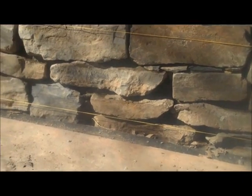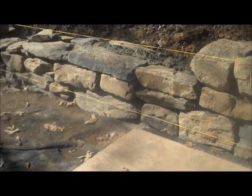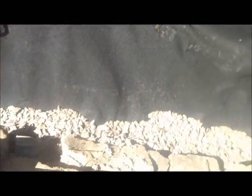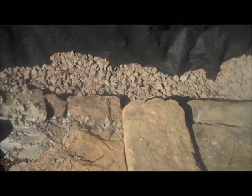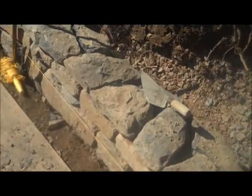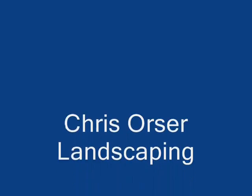It's just a really nice natural-looking wall, and with the techniques we put in behind the wall, it just helps it stand the test of time. We have geotextile fabric, we're going to put in the drainage pipe, and we're going to put in stone behind the wall. Essentially what that does is alleviate any pressure from the soil and the water so the wall doesn't fall.